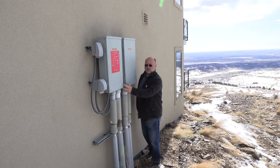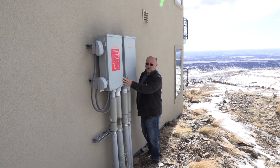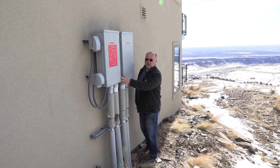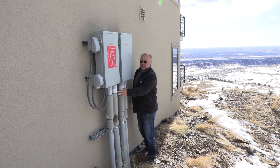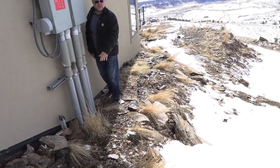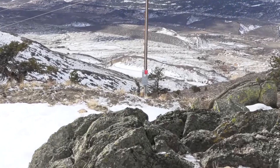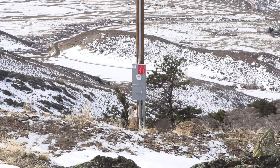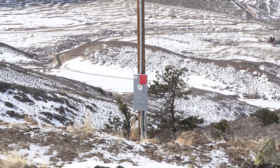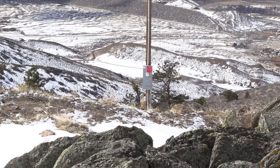On the outside of the house you can see my two service drops — 200 amps each — coming into the side of the house. These go underneath the floor into the utility equipment room I showed earlier. You can see the supply for these 200-amp services going underground out to the pole. On the pole is my service meter; you can see the two services coming out of the bottom of the meter set and the transformer that was dropped for the home. Your system will be similar but likely a little different from this.